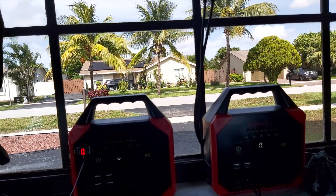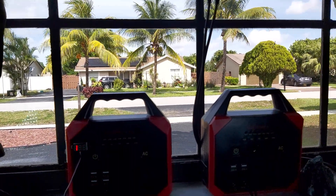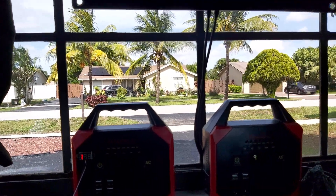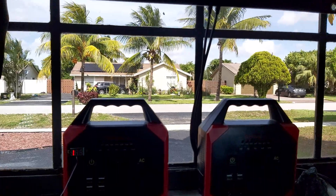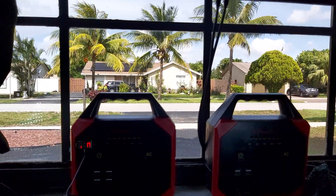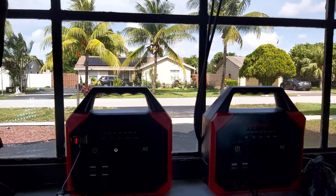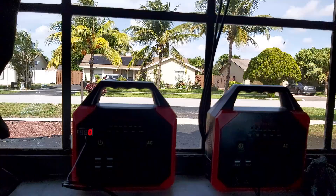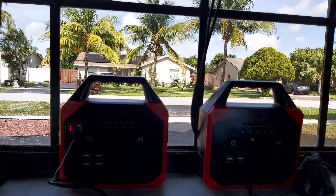I have a dual antenna — one facing south and one facing north — so I get two markets. We're supposed to get 137 channels here with 4K broadcasting, and I have eight high-definition TVs throughout every room running through a distribution amplifier in a modified cable company box that I own. I disconnected all their wires and put it into mine. All I get from them now is internet. I have clear HD picture and 5.1 Dolby Digital audio in every room. Now I just want to add solar and maybe an RV cell antenna for stronger cell signal.